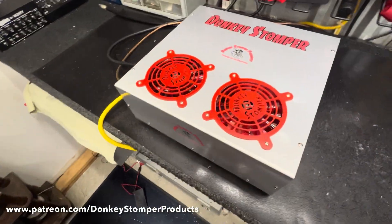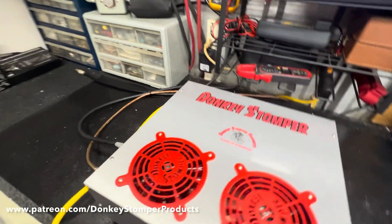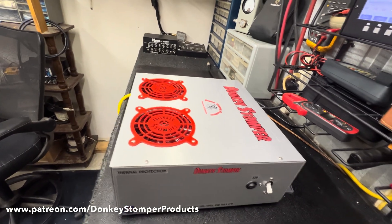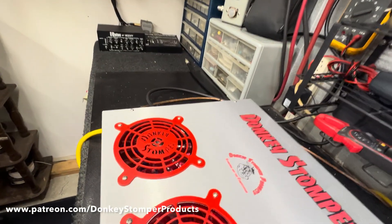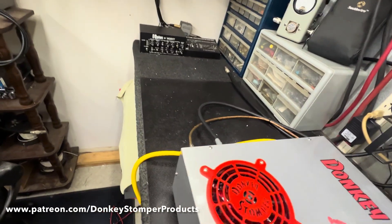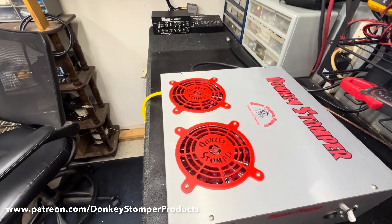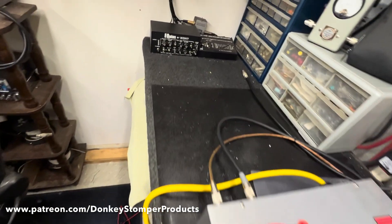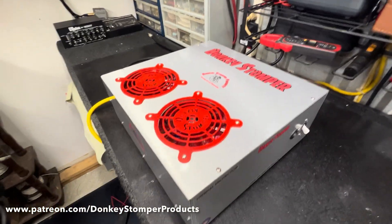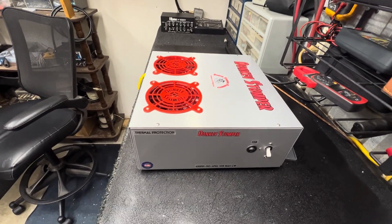There she is — the Donkey Stomper four-pill base, sideband, bias, thermal protection, on and off. What it does is: when it gets too hot, the power supplies stay on but the amp will quit keying. You just let it run, let the fans cool it back down, maybe flip it on and off a couple times, and then come back and start working. Hopefully you never kick it off — there should never be a reason — but sometimes it happens. Alright guys, y'all take care! Your friend, Team 018 Beavis Donkey Stomper, catch you later, bye!